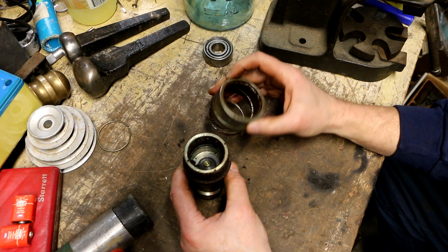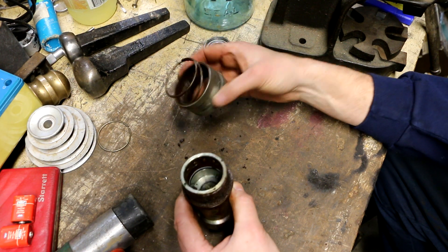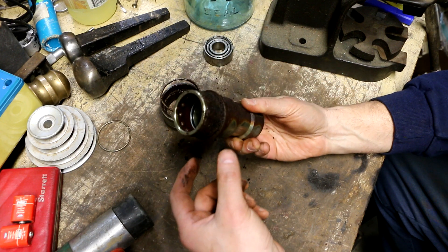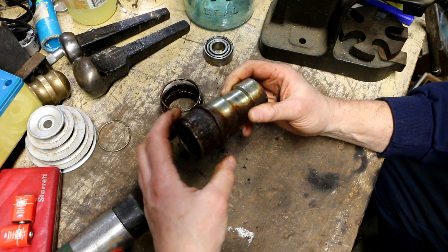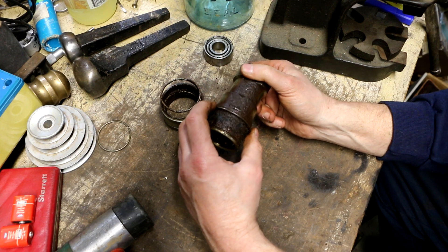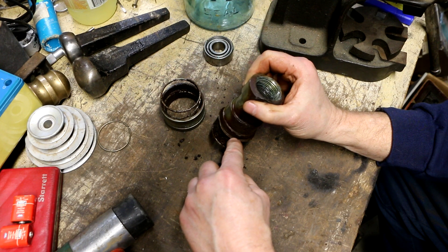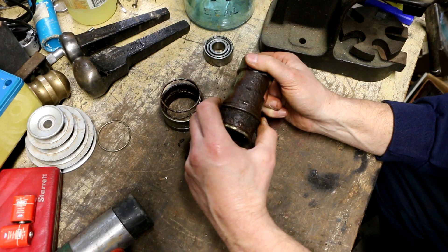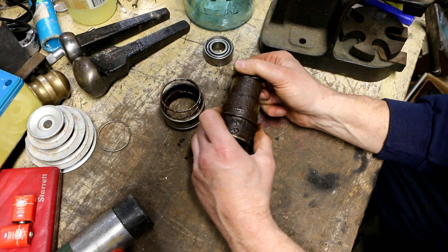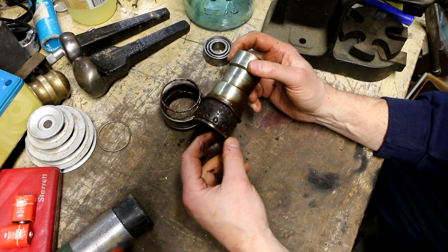Now I can take the ring off and get my push bearing out. You can see all the crud falling out of it. This ring right here is what keeps this collar from going too far back, and it's not supposed to be bent like that. It probably was seized in one section and not the other, and when I was banging the collar I probably ended up deforming it. But once I get that off I can bang it flat again and it should be okay. It doesn't even want to come out past the rust on here.